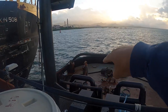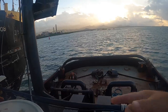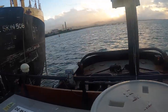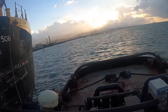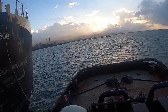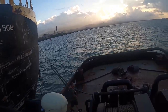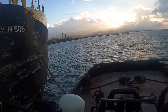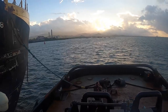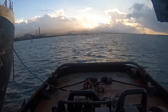We're going to bring the barge's bridle over to our towing wire. In order to do that, because things weigh so much, we have to get the soft line over here on the second winch — what we call the suitcase drum. That's actually going to pull the bridle over, because the weight of the chain, the fish plate, the pennant, and all that stuff is probably going to be over a ton or two. So in order to pull that over, we need a big winch.